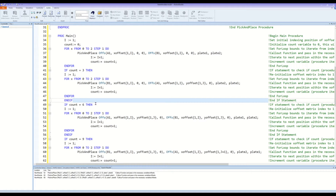Once again we will use an if statement to check that the for loop iterated 3 times and placed the objects correctly. The index of the X offset array is re-initialized to 1 and a for loop will again be used to call the pick and place function, index the X offset array, and iterate the count variable. This section of code will pick the objects up from the second row of plate 1 and place them in the second row of plate 2. A1 is our pickup point — the Y offset shows that it is from the second row. B1 is our place point and again the Y offset shows that it is in the second row. Starting in plate 1 work object, ending in plate 2 work object. Again you have the end for and end if statements.